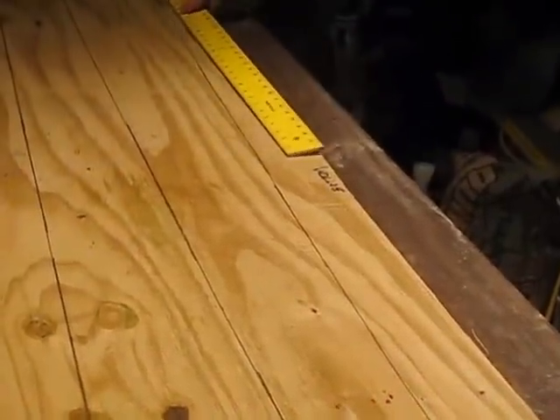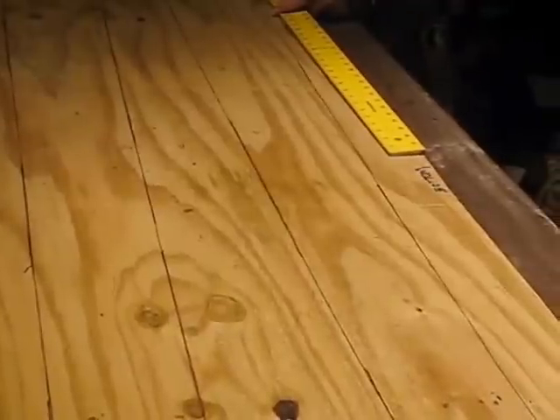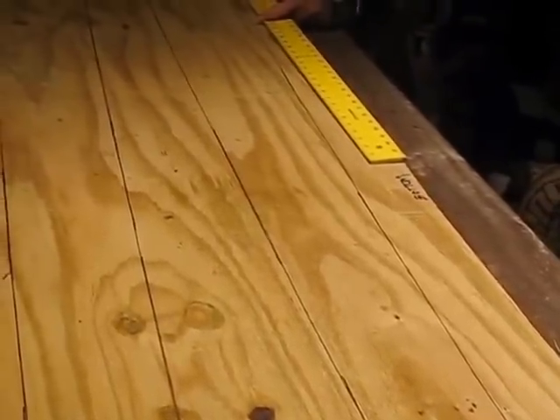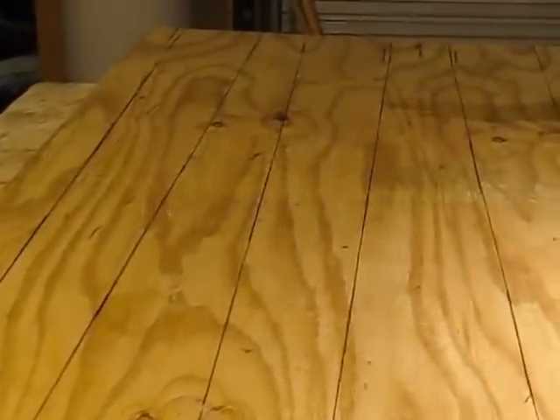We are laying out a four-by-eight-foot, three-quarter-inch copper tubing thermosiphon solar collector with a gradual upper slope so there would be no air bubbles caught in the flow of the thermosiphon.